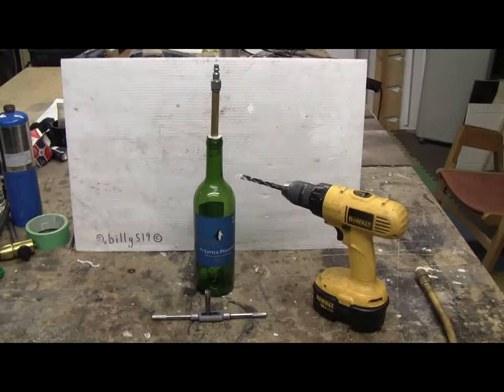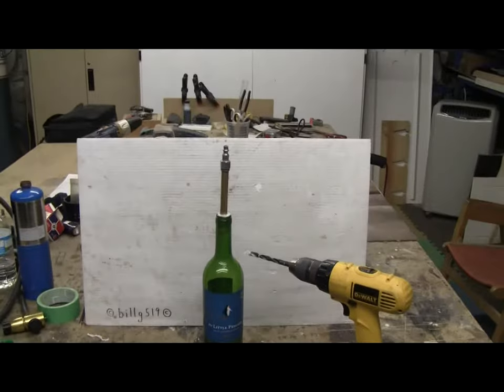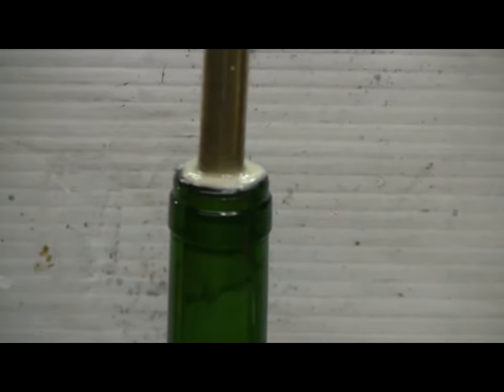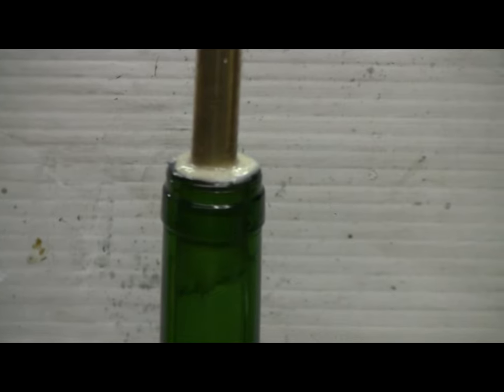Here's the wine bottle again. The epoxy plug has hardened. I've drilled and tapped for one-eighth NPT. Then I've wet the threads on my adapter with epoxy and threaded it into the epoxy plug where it's now hardening. There's a better look at the neck of the bottle. Hopefully that will be able to take lots of pressure with no leaking.